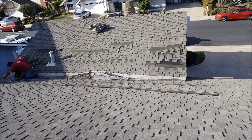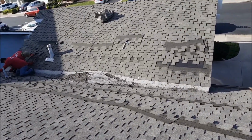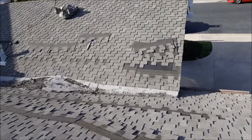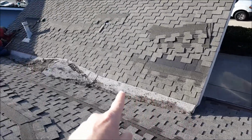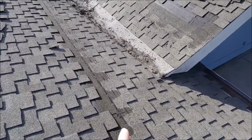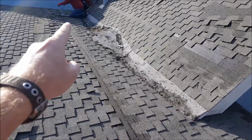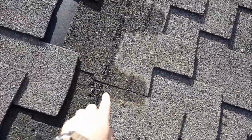When you replace these crickets though, a lot of times people just coat them. You're gonna see this thing is just hammered. It's toast. It's totally toast. So you got to get this whole area out, which means you have to take off a row of these shingles going all the way across and get this row all the way out, and then we can get all the nails exposed. Once you get the first row out, you can see, well, they didn't even use nails,